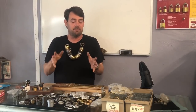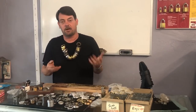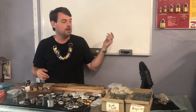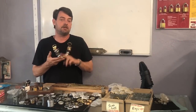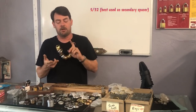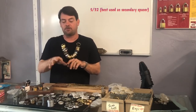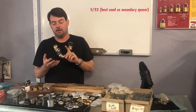Physically it's not that big of a deal, but you will need to keep a certain stock of spacer rings on hand if you do any type of commercial work. I'm going to use a little whiteboard here and talk about the three most common sizes of spacer rings that you're going to need. Starting at 5/32nd — these are available through ILCO, GMS, and Keydex. We're going to talk about security rings towards the end.